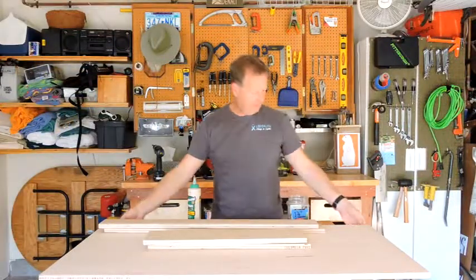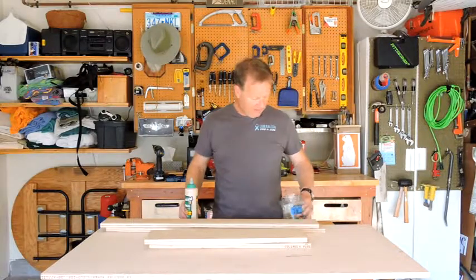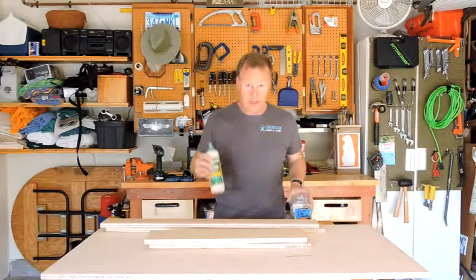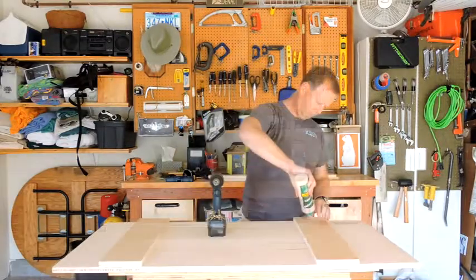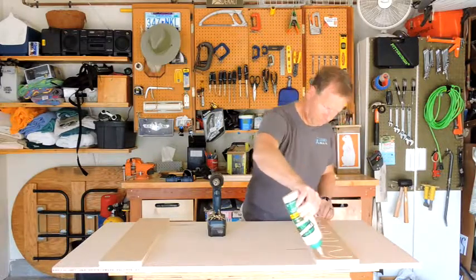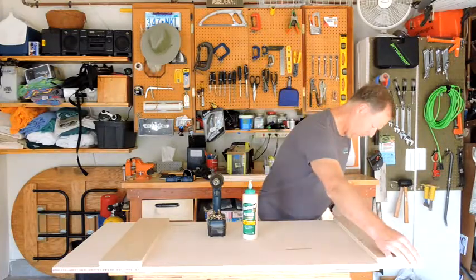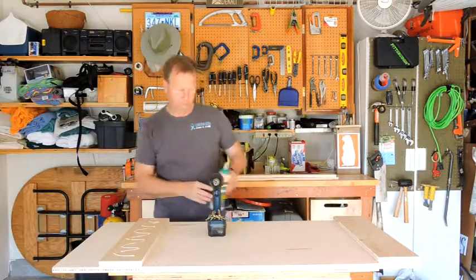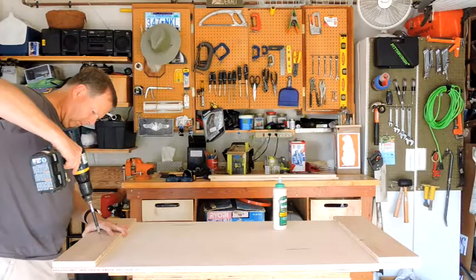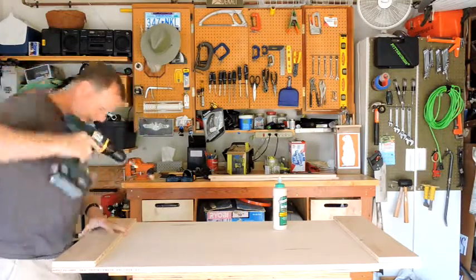In addition to your two by four foot handy panel, or whatever size plywood you want to use, you're going to want some one and a quarter inch construction screws and wood glue. I've pre-drilled eighth inch holes in the stiffener boards.